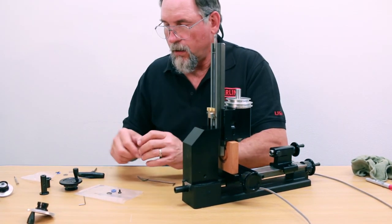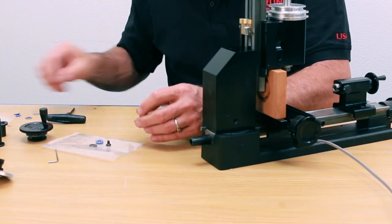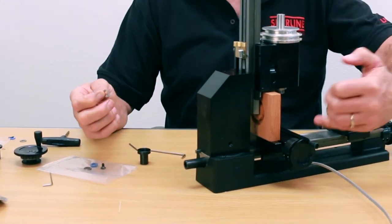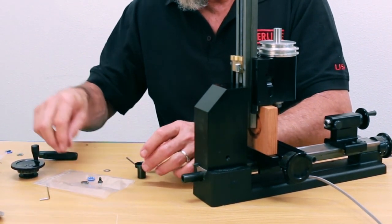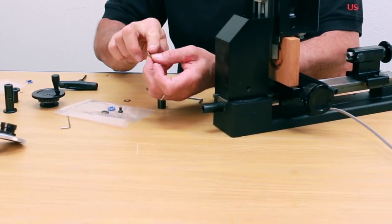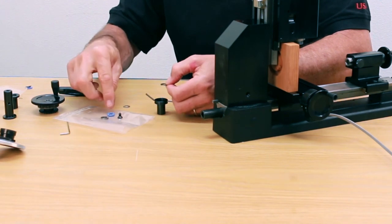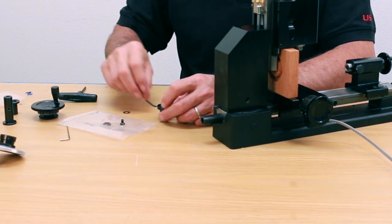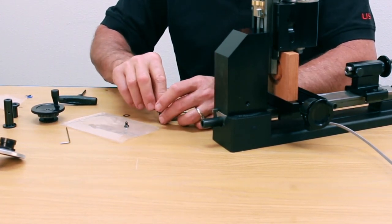When you get your new parts for your DRO, this is the DRO thrust collar and it's got the groove in it. Your package is going to come with a shim washer. We're going to put the washers back in — one side has a slightly rounded edge and the other side is a little square. Put it in so the square side is facing the actual bearing and the rounded side is facing away. Then put your bearing back in, then the other washer on top with the flat side facing the thrust bearing.